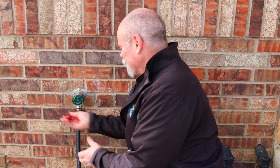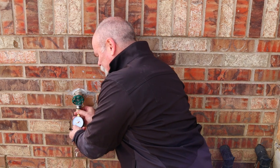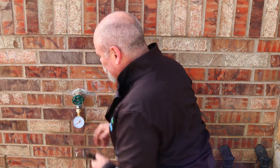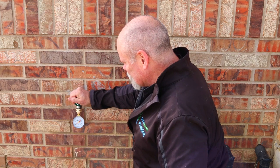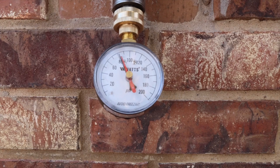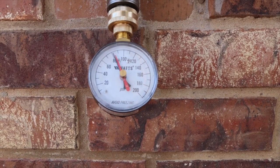Now that the sewer line is full, we're going to disconnect the hose and get the gauge on here, then shut off the water meter so we're running both tests at the same time — that way we're not out here all day. These gauges are great, not very expensive, and you can pick them up at any plumbing supply house or box store. I like these Watts gauges — very good. Since it's a vacuum breaker, it's going to spill out a little water and then take pressure up to city water pressure. This is why we do not call this a hydrostatic test: we are not applying any external pressure. This is city pressure, and we just want to make sure it holds for 15 minutes.